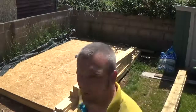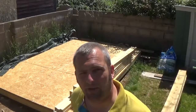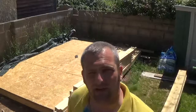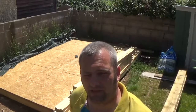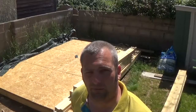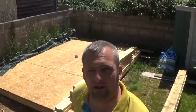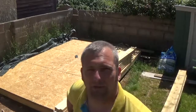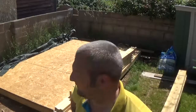So it should be quite light. What some people do is put the cladding up the side of the frame and then you just attach it and it's all done. But because I'm working on my own I'm going to do it as light as possible — just do the frames, put it all together, and then do all the cladding afterwards — all the feather edge stuff. So I'll do the feather edge in situ.